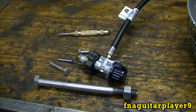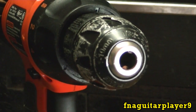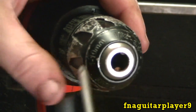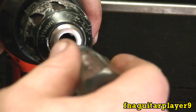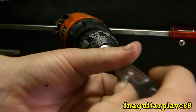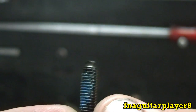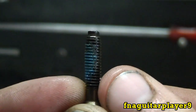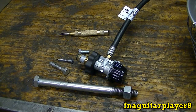Another left-hand screw I ran into is the one inside this drill chuck — it says Torx drive and it's a left-hand screw. If you look, the threads are up on the left side, so it's left-side up, meaning it's a left-hand thread. That's about it.